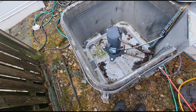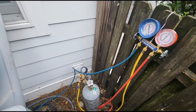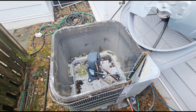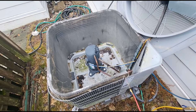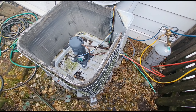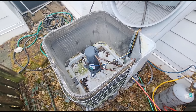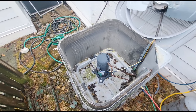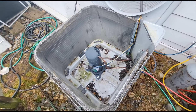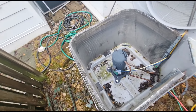It kind of sucks having a leak but you can't hear it or see it. What I'm going to do is close the valves on this condenser — I don't want to overfill this unit. That evap coil upstairs is only pressure-tested up to 450 PSI, so we just can't keep adding pressure until something leaks. We don't want to blow the joints on the coil.